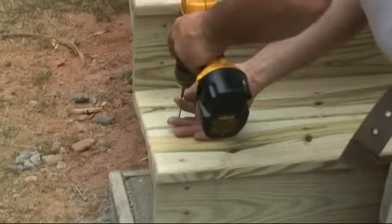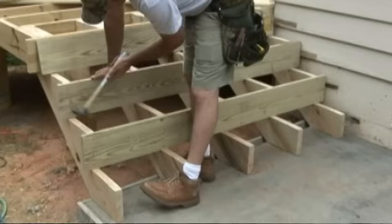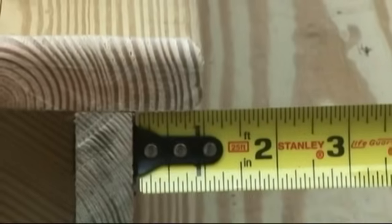This should consist of two decking courses for each tread and one course for each riser. You should allow for a half-inch to one-inch tread nosing to project over the riser boards. Verify all building code requirements and techniques shown in this video with your local building department.